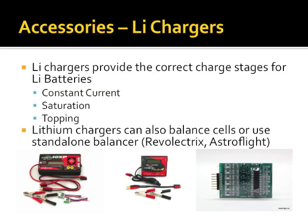What it does is if you're trying to measure the discharge rate of a battery, you hook it up to a near empty sealed lead acid battery and it will charge the sealed lead acid battery, but it's basically energy transfer. The one in the middle is specific only to lithium batteries. It will only charge lithium batteries because it only does it through the balancing port.